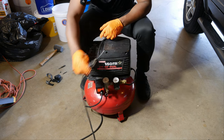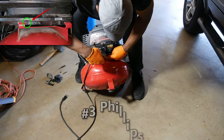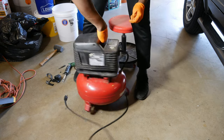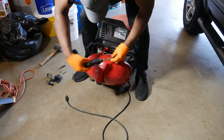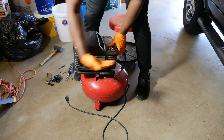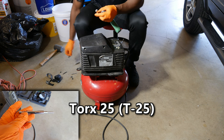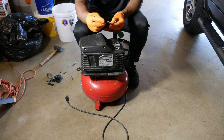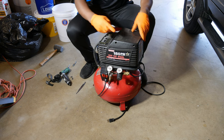I've already unplugged the compressor and relieved it of air. Next, remove one screw from each side securing the compressor to the tank with the number three Phillips, then slide the housing off the tank. The housing screws are recessed fairly deeply, so I cut the brand labeling off a couple of bit holders, then used a Torx 25 bit to remove the three screws around the top. I cut the labeling at the housing seam to separate the two halves.